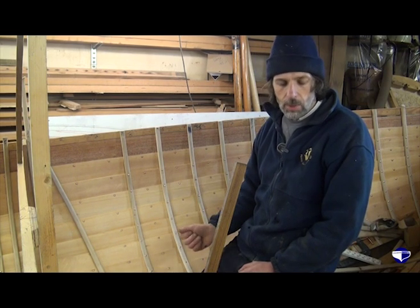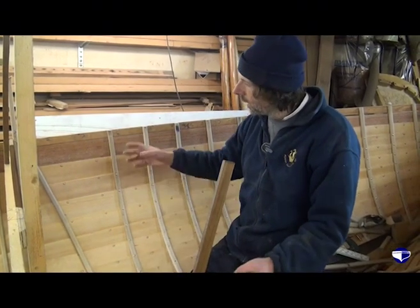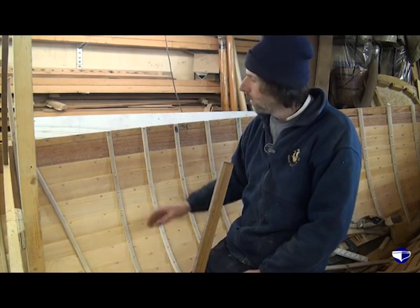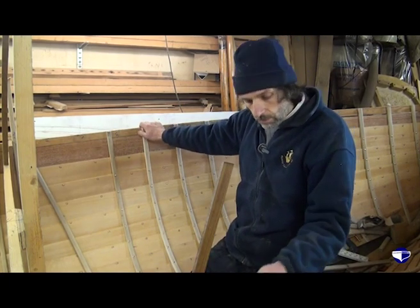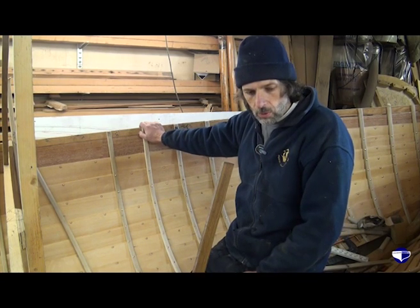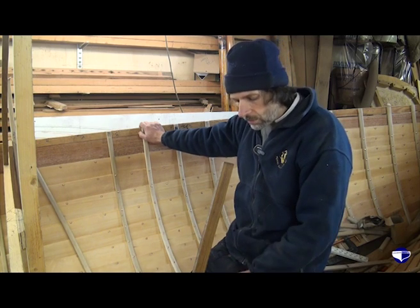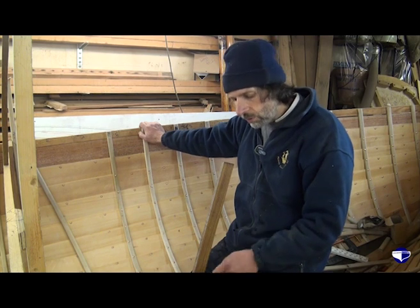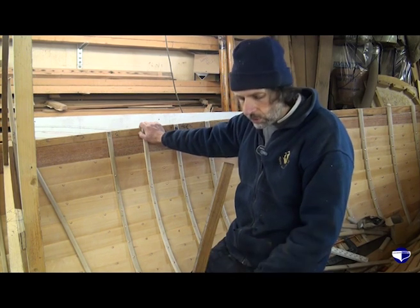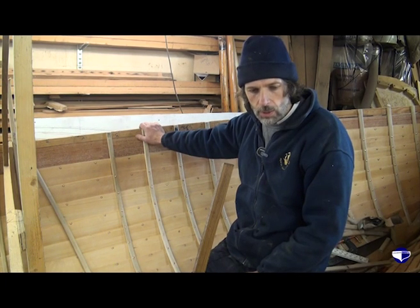And because we haven't hot nailed the boat, hammering the nails in when the ribs are hot, we've got chance now to unclamp the ribs from the batten at the top, which we've just done. We've just sanded up the surface of the rib to make it a bit cleaner, and then we'll clamp it in place, drill out through, nails in, roves on, snip off, tap tap tap, rivet the end of the nail over.